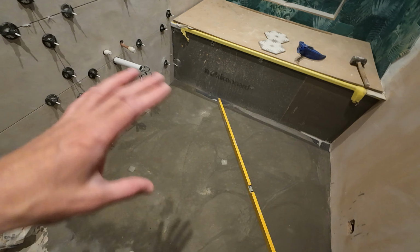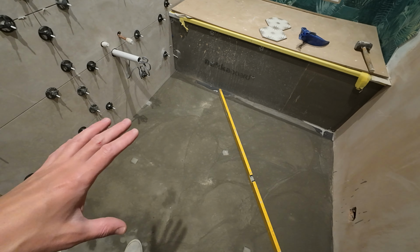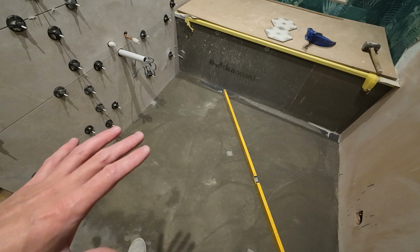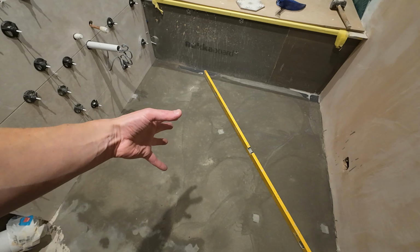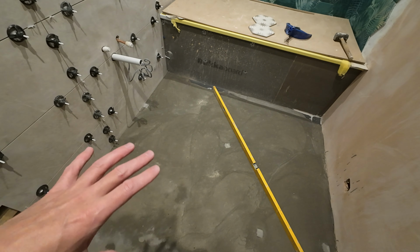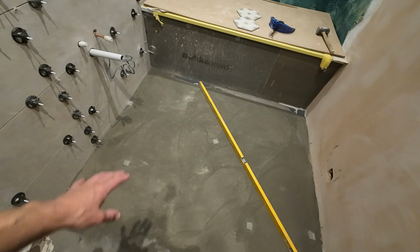And if you're doing big floors or even this or a small floor, it's good to have all your water and your self-leveling ready to go. Ideally, if you can have 2 buckets or 2 bags knocked up, because you're generally going to be adding to what you've poured down, then it's good to have them ready to go because you don't want to leave it too long before adding to another pour that you've already put on the floor.